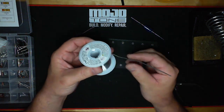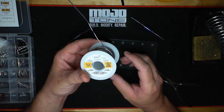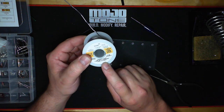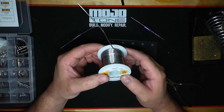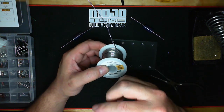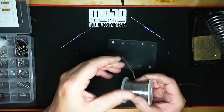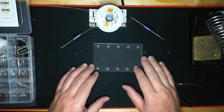Every tech I've ever known has used this solder. It's getting more and more expensive — 20 years ago you could get a roll like this for five or six dollars, but now it's around $40–45 for a pound. It's 0.062 — a 16th of an inch thick. They also make thinner gauges — I think 20, 40, 60, and up to 75 or 80 thousandths. This has the flux built into it, which you'll see when I start soldering. If you've watched the 5E3 videos, you'll notice the wet area around the eyelets — that's the actual flux built into the solder. So you don't need to use a separate paste flux. This stuff is worth its weight in gold for this type of work.